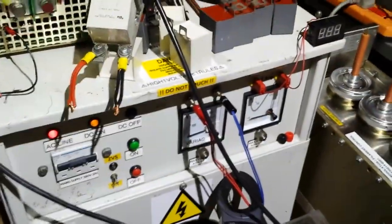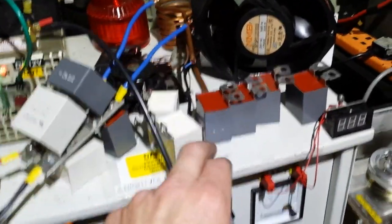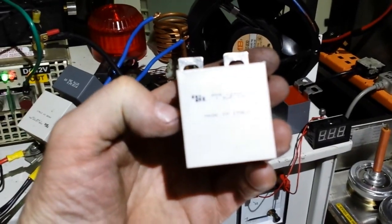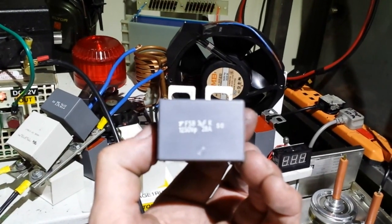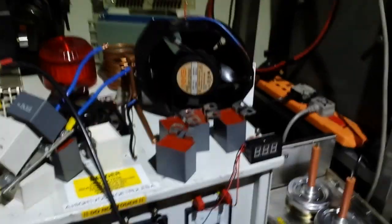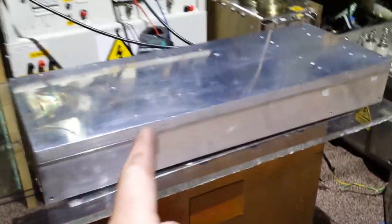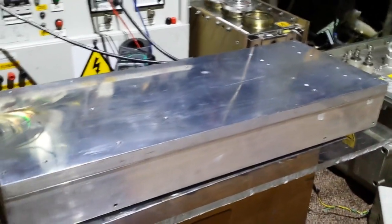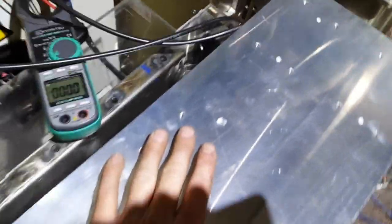The grey caps just there came off the units — I've got six of the grey ones. I've also got four of these white ones which I got some other time. These are made in Italy at 1200 volts, 1.5 microfarads at 10% tolerance. These ones here are 1250 volts at 3 microfarads, 28 amps each. I'm not quite sure what amperage the grey ones are — these could be 28 amps as well, because these were off IGBTs from big UPS power controllers. I'm quite happy with these.